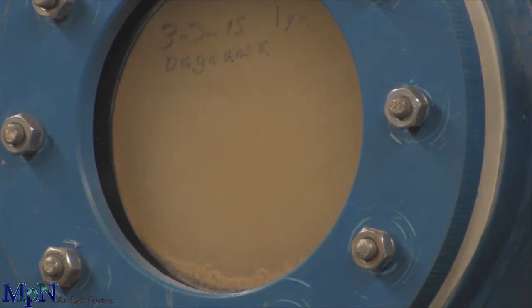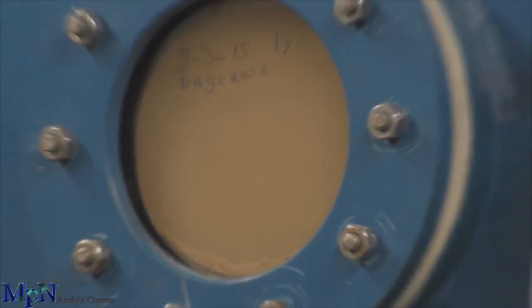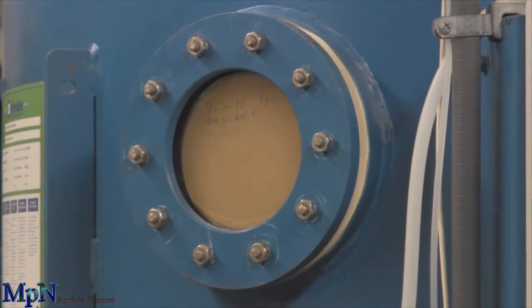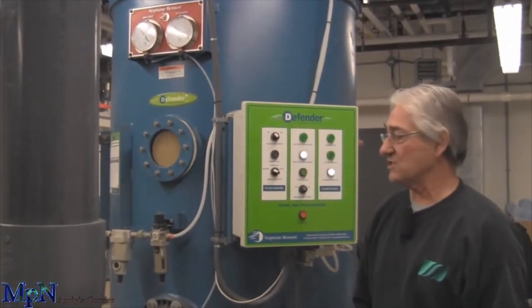When the pump is off, our gauges are at zero. At that time the effluent gauge — the valve that goes back to the pool — is closed, and the re-pre-coat line that goes back to the front side of the pump is open. It'll go through this cycle, the ten bumps, then it will restart the pump. This is on a VFD so it's a slow start.